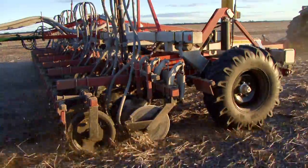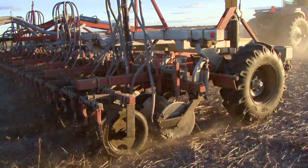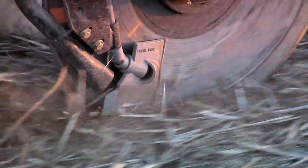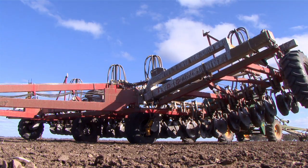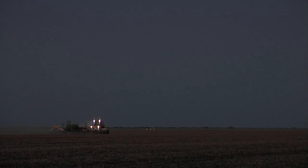The scraper system on the machine works very well — it's very good for our conditions. When it's too wet we have them tight, and when it dries out later in the season we drop them back so we don't wear our discs out so quickly. Very easy to change — a five-minute job and it's all done. So even if you had to change them from day to night, it's not a big deal. That's one of the major benefits because we're a big operation. I have to have casual staff — I'm not ever driving the machine myself. So I have to have a machine that's relatively simple but still does a precision sort of job. We can't be out there fixing everything all day long, so it needs to last with the casual staff.